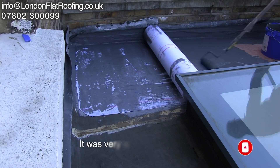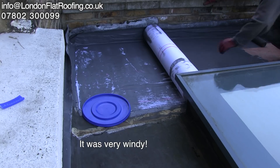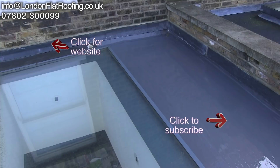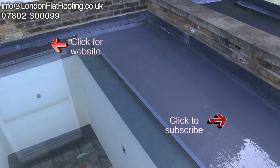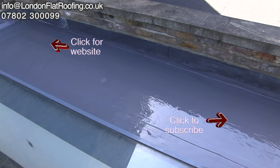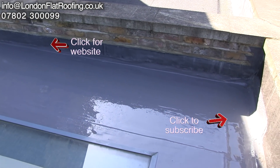Let's sum up what we found. We found three things wrong: no vapour barrier, no venting of the top cavity, and the coping stones didn't have the correct drip detail — the coping stones were too small. Hopefully you've enjoyed this video. Speak soon.